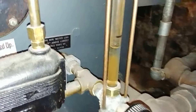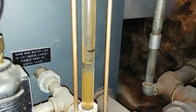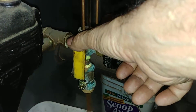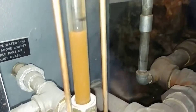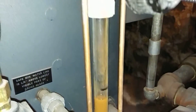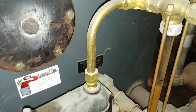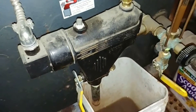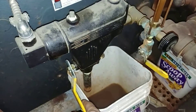You can see the gentle bob on the sight glass. We're going to do a sight glass test. You can hear the pressure. You can see there's still a lot of rust in this system — this system is fairly old, so it's going to have a buildup. We're going to test the low water cutoff, and this is how I had advised doing it: just open it up.